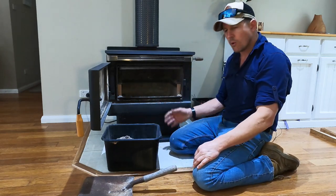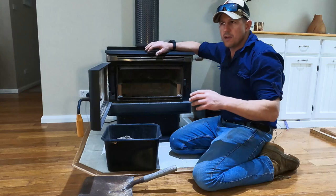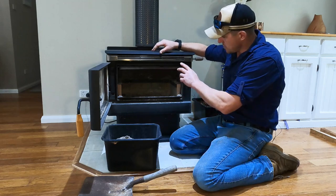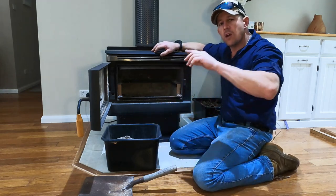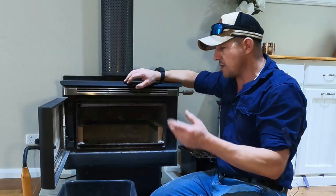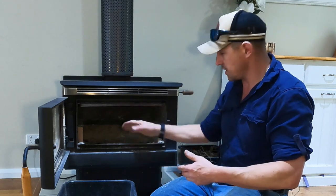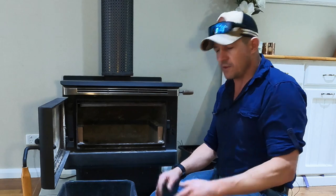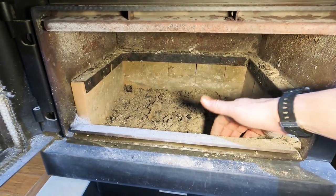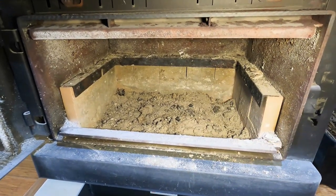You'd be surprised how much more room there is in the firebox now — and that's important from an airflow perspective. This is roughly a 10 kilowatt unit; it's not a big fireplace but it's the perfect size for this house. A lot of these have holes in the back that allow air to come through, recirculate, and reburn once the convection gets going. The less room you have, the less oxygen and the less room to burn, and you're disrupting the flow these units are specially designed for. If your wood just isn't taking off, that can be one of the main reasons. You can see how much more room there is now — about 25 mil deeper — and I just maintain that throughout the winter.